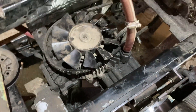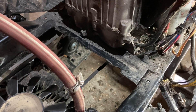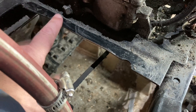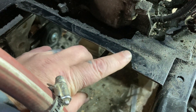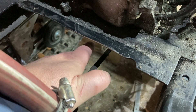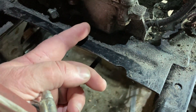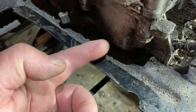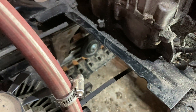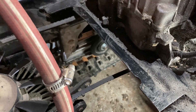I'll do a little bit of thinking and come up with something. I think I've got a plan: I'm going to build a bracket that bolts to here, comes down, goes across, comes back up, and bolts here. I'll have a lever on there that pivots back and forth with the pulley on it. The lever will go through that bracket to right underneath the motor, and then I'll put a chunk of ready rod through one of those holes that will hook onto it and pull the pulley into the belt. That'll be the first try — whether it's going to work, who knows.